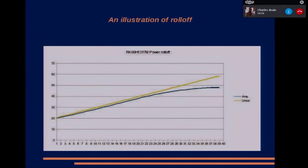It's not particularly easy to see on this graph, but that graph is really an S shape, because you get some loss of gain on small signals as well as on high signals, and it's to do with the crossover in the Class A/B amplifier. I'm no amplifier expert, even though my first job was designing RF amplifiers, but I soon decided that software was easier. But you can see that there is quite a significant distortion in the thing, and this is just the AM to AM distortion.